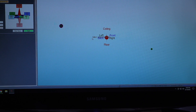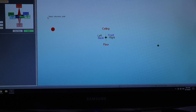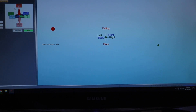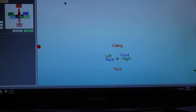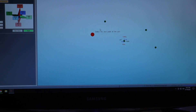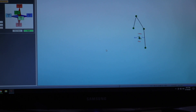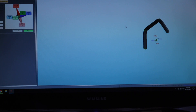I'm going to hit Apply, go to the left side, hit Apply — that's outside to outside. We're going to hit Clear Values, reselect our pick point. I remember last time I went up 8 and over 6, so I'll hit Apply, swap it to the other side and hit the left side, then hit Apply. Then what we're going to do is go to Bend, enter 2 because there are two bends, hit OK. We're going to click this pick point, go to that one, go to this one, and then go to that one. There is your bull bar. And if you want to see it in real time like an actual tube, you hit Display — and now you've got yourself your bull bar.